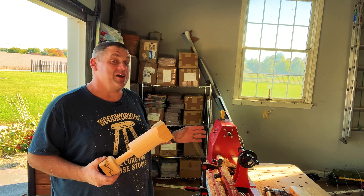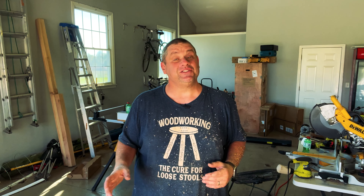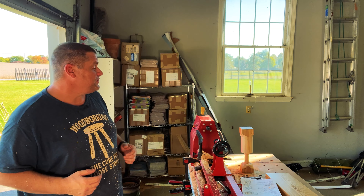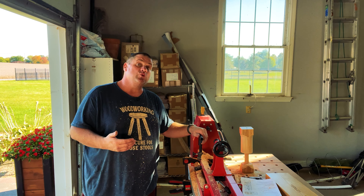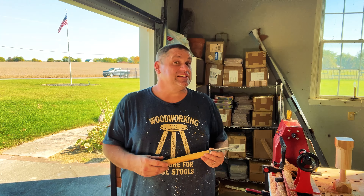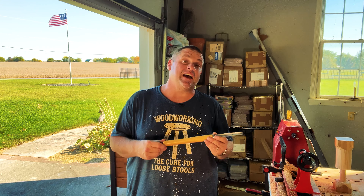I'm quite pleased with the form and functionality of this lathe. For my first turning project this turned out okay, and that's all I was looking for. I obviously have a lot more to learn, but this was a great experience. And for just under $200, I think this is a great opportunity for somebody who wants to get into woodturning but isn't quite sure they want to spend a lot of money. Now there are a couple of items I'm a little concerned about. First and foremost is the tool rest — when I was turning, the tool rest came loose a couple of times. I had to stop the lathe and tighten it down, so that's something I'm either going to upgrade or pay extra special attention to every single time I use this tool.